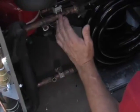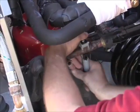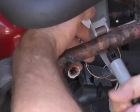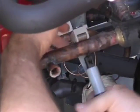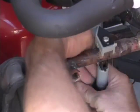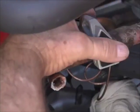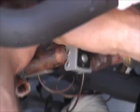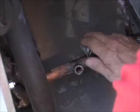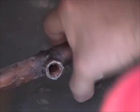Next we're going to go ahead and cut our two water lines. I'm cutting as close to the brazed connection as I can so I can go ahead and couple it. Because this is the water side, I can soft solder this with 95/5 solder or I can braze it — either one is perfectly acceptable because we're not talking about refrigerant pressure here, only water pressure, only our closed loop fluid. Make sure you're using good tubing cutters, not a hacksaw or Sawzall — you want to avoid putting metal shavings through the system. And I hope I don't have to mention that's also a no-no on the refrigerant side. We're using a close cutter down here on the bottom connection which is able to clear the pan.